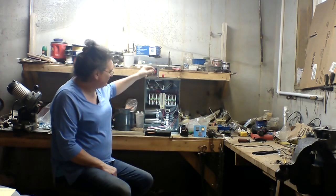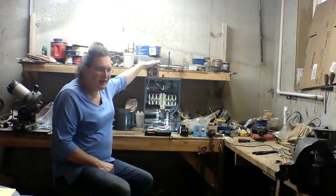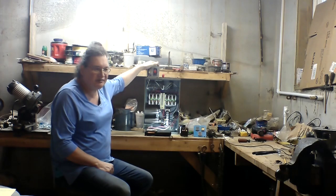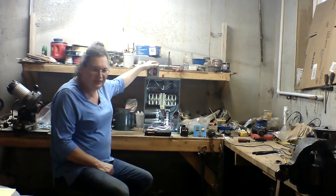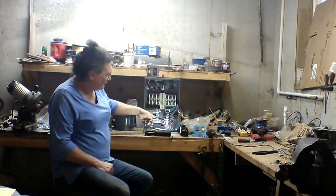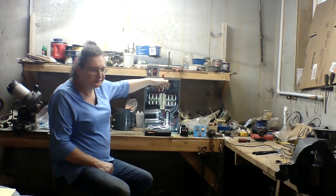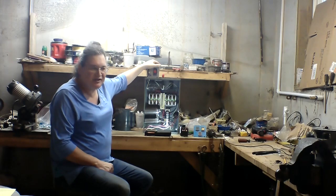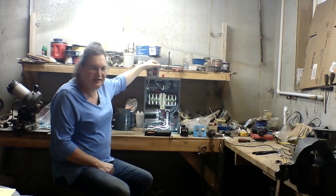I hand-built this box quite a few years ago. This is about its third rendition. It's been used for everything from a panel box in a garage to powering some simple machinery, and its last job is being my three-phase converter to go from a single-phase 220, 30 amp circuit into two 15 amp three-phase circuits, or at least the third leg of the three-phase is simulated.